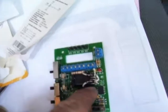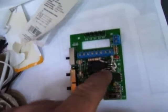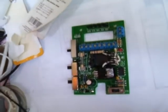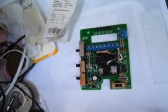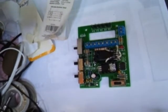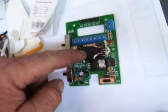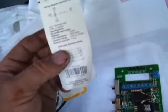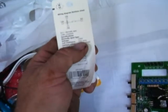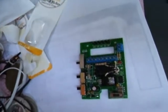There's a contact across this one and a contact across that one. I had to use two relays because they're each a single pole, single throw. The original was a dual pole, single throw. I just had to switch two of these little relays at once, so I had to parallel the two coils together. These are real high impedance — the coil resistance is 1050 ohms — so it doesn't load the circuitry very much at all to turn these on.